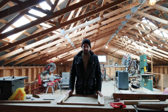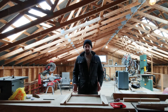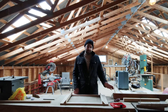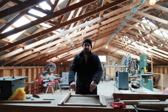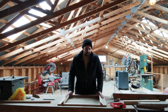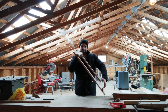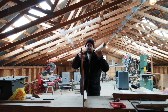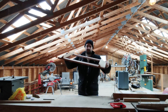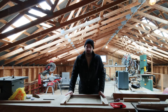I'm here in a different wood shop because I'm not very good at woodworking. My plan for this frame didn't exactly work when it came time to go home and mount the monitor. I'm home for Easter and my parents have a wood shop as well, so I've been taking advantage of my dad's table saw here. The problem was running a bar across the top pushed it over the edge of the frame and the corner joins no longer held together. The glue didn't hold well, so I did a second pass using a ratchet and webbing around the corners, and it's held much better. What I've done is added a 45-degree cut 2x2 with holes drilled to attach the frame and bind to the monitor. The monitor is going to drop right in there and the glass will be sandwiched between it all. I'm way happier with this design — it's pretty easy to set up and I think it's going to hold onto the monitor well.